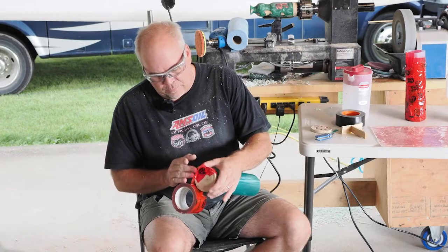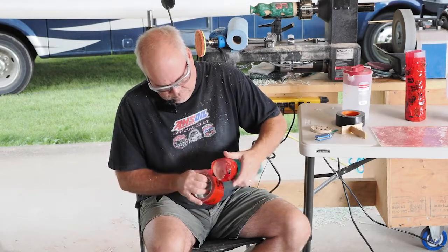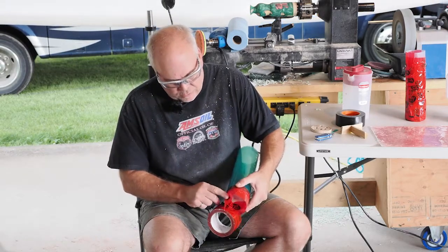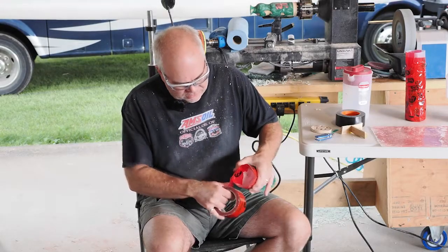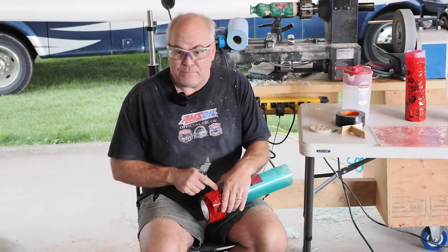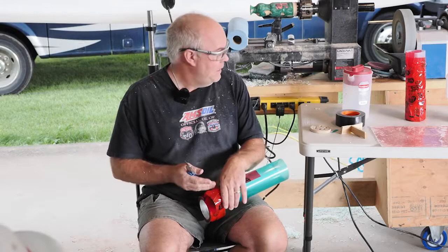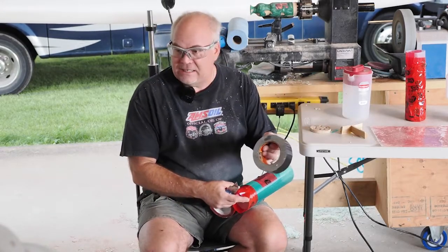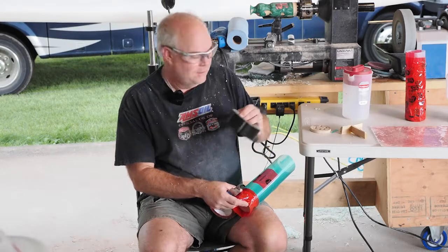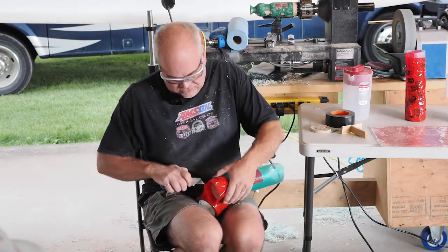Once I have that done, I go back to the roll of duct tape. I place it so it overlaps the divider and the wood piece, about half of it so you can fold it in a little in the next step. I'm trying to seal between the plastic and the wood because epoxy will find every little crook, every little nanny. It'll de-bond the tuck tape from the wood piece, so you've got to make sure it's sealed underneath. I'm starting to play with duct tape because it seems to stick to the wood and the epoxy doesn't affect it as much as the tuck tape, though it's a little more difficult to work with and a little more expensive.